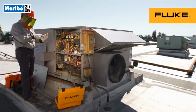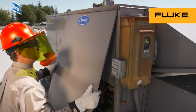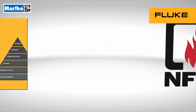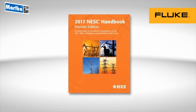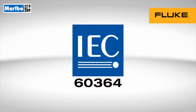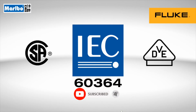That means following all company policies and procedures, as well as OSHA and industry best practice standards, such as the National Fire Protection Association's 70E, the standard for electrical safety in the workplace, or the National Electrical Safety Code. Outside the U.S., the standards may be different. Many countries reference IEC 60364, the Canadian Electrical Code, or German DIN VDE.